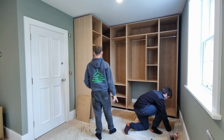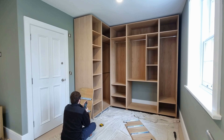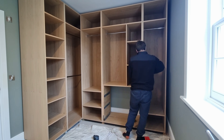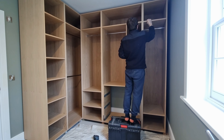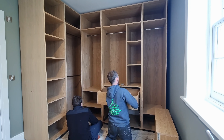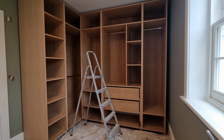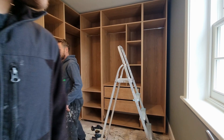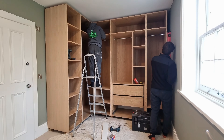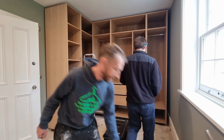We did quite well — I don't think it's even past one or two o'clock and all the carcasses are in. The drawers are fitted using the cheek system. As you can see in that little slot, the cheeks are 25mm or 26mm oak veneer pieces with a small notch taken out for the hinge to sit at the bottom. The runners fit on those and the drawers slip in, so we utilize as much space as possible without any boxing in.